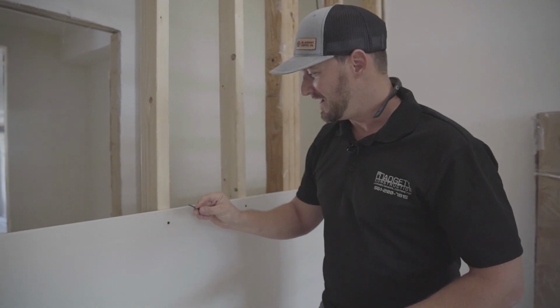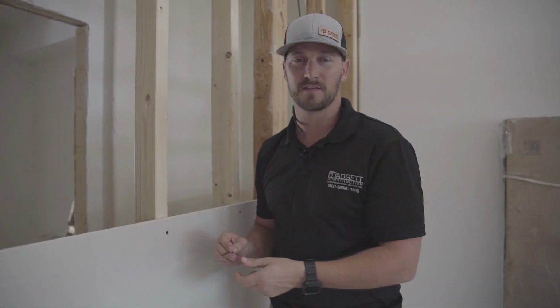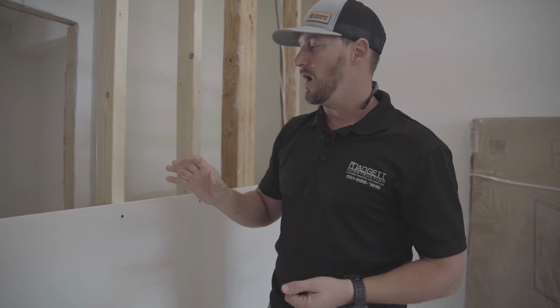But back to the drywall and away from my ADD: coarse thread screws through your drywall into your wood frame studs. So you can use these wood frame studs in your container. It's no problem, a lot of people do that.